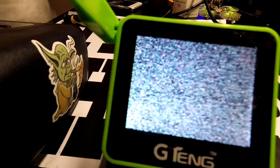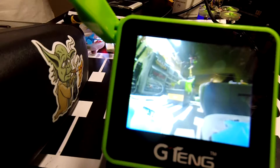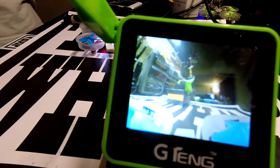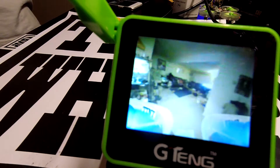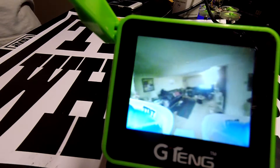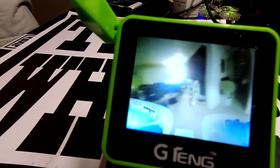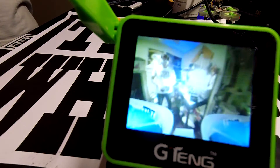One of the issues people mention is that when you just remove the capacitor, you get dirty video. So let's do a quick lap around the shop and see if that dirty video exists with the fix we've done. Seems powerful, flying low. Video seems to be alright. I think maybe one reason it may cause bad video is that a lot of times when this happens the camera is already attached and it's getting reverse polarity as well. It's flying like it's brand new — I don't know if this is going to fix everything, but it's better than having to throw it away.